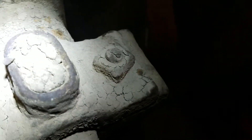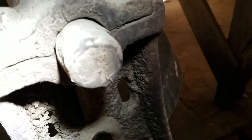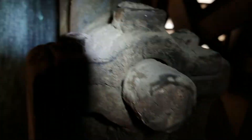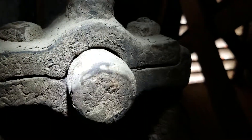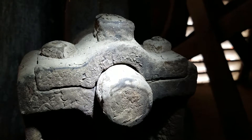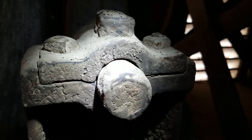Here's another good example — the first bell I showed you. The oval area is where the grease is put in. That's the pivot pin, and obviously that grease has not been touched in decades — all dried out, with probably a lot of grit and dirt inside there. If you can take those two bolts, take that cap off, clean that hole, pack out the oval area, and then repack it with grease, that really will help. These are rope-rung bells, so doing that would really help make these bells smoother, with less vibration and nice and easy to ring.